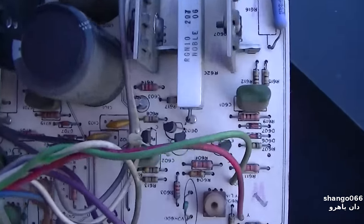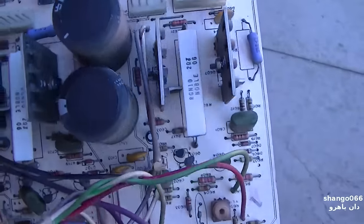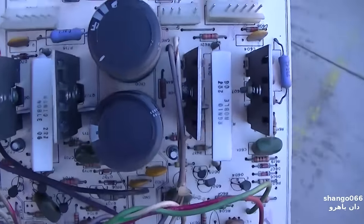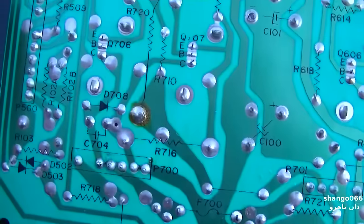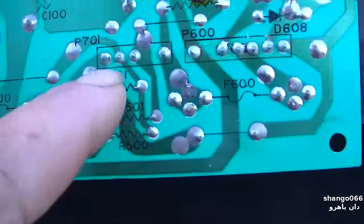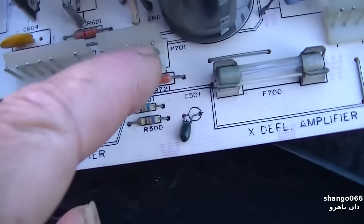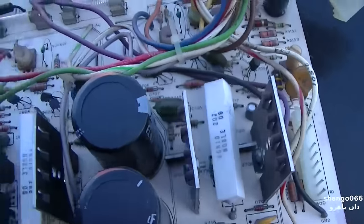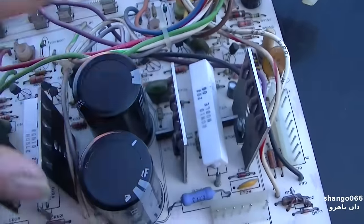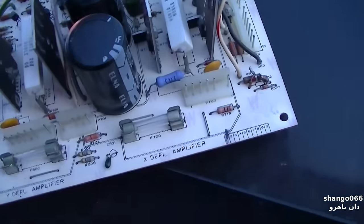I could reflow this real quick and slap it in and see what it does. You know, this works a little bit like an old-school oscilloscope with the X and Y deflection. I completely went over and reflowed all of these headers - every one of them was completely cracked beyond belief. I'm surprised it worked at all. Then I went over the whole board with a good magnifying glass and it looks good. I'll slap it back in and see if it works.